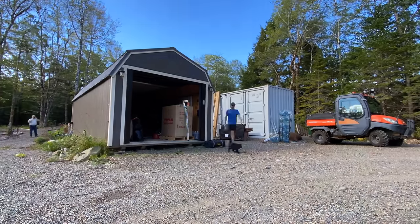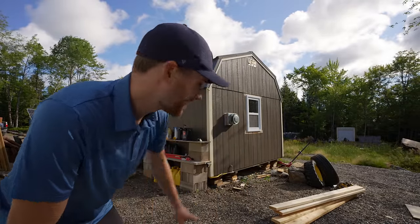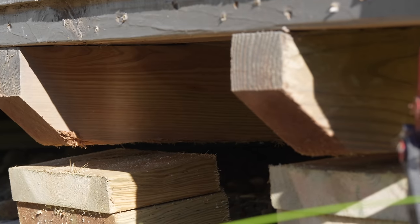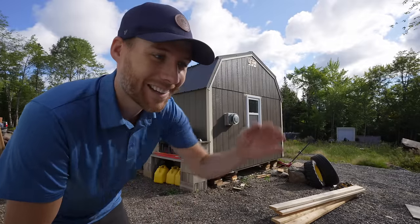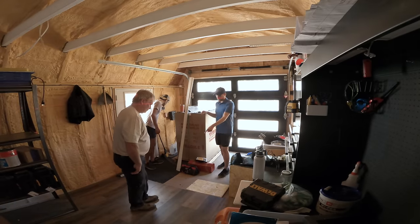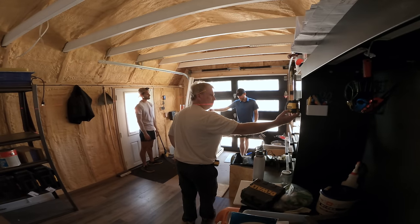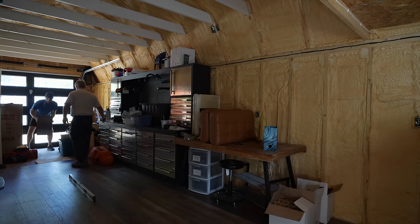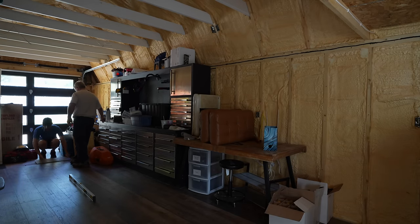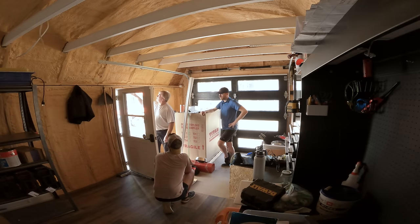We're within a quarter of an inch — compared to the four inches it was out, it's pretty bang on level. Look at that corner and how much it's built up with blocking. It's crazy it was basically like this for the last few years. Better to do it right though. So we have the insulated subfloor to go under here — the plan was to tile this section too. But it won't fit with the door height, and because we were out of line for so long we've got a gap there.